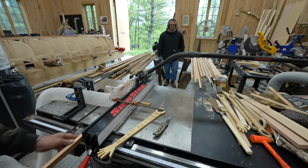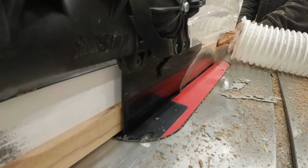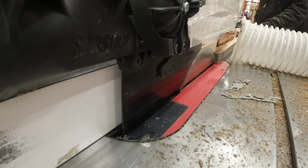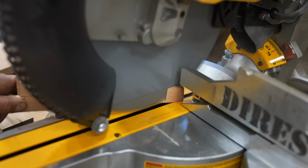And I set up a system here where all the planks were the same size and had the vacuum sucking up all the lead paint. And there's my brother on one side of the saw, I'm on the other side of the saw. Now I had a plan to make sure all the good clean wood faced out, and anything that had severe staining or paint or any kind of texture from the weather would face in, so that ultimately I could use all the wood facing in to create a reminiscent texture of where all this wood came from, because the inside gets a lot of woodwork.